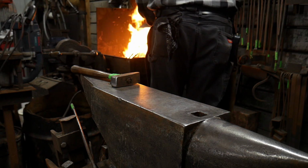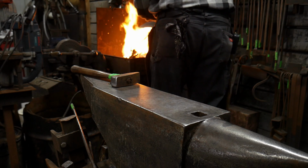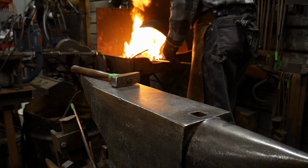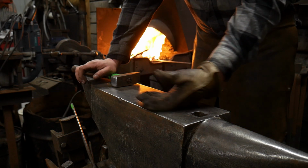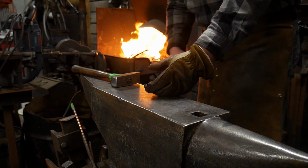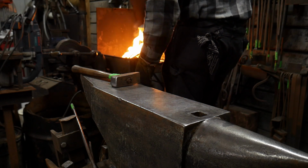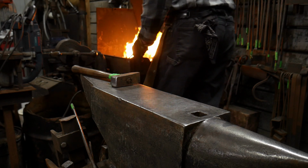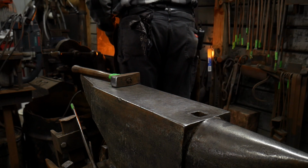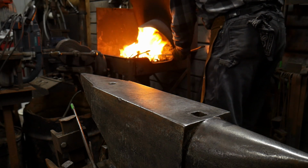Here we go. Going to town. Bring this up to full heat and we'll see where we're at. Now, I will say this, I've got a big old clinker at the bottom of this fire right now. The way I can tell is because I've got to push extra air through the fire to get it up to temp, and I don't like doing that. So that tells you there's too much clinker sitting at the bottom. Okay, this is good and this is out of heat.